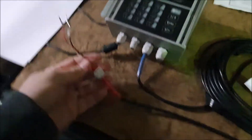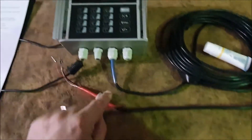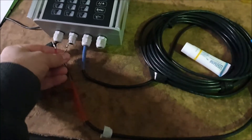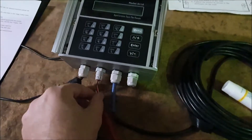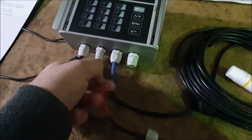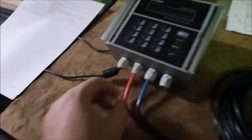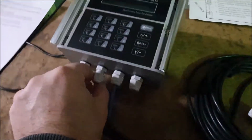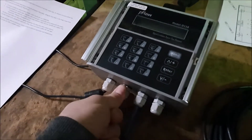Putting your cables through — I've got those two connected already. This is just one of the transducers, so take off the nut on one of the cable glands, slide it on — it's going to be a little tricky with one hand, but there we go — and tighten up the cable glands. These will provide a nice waterproof seal.